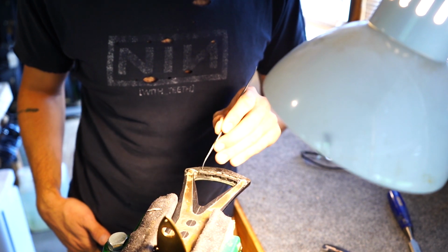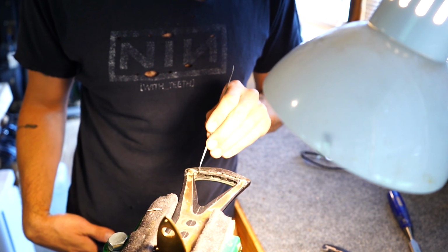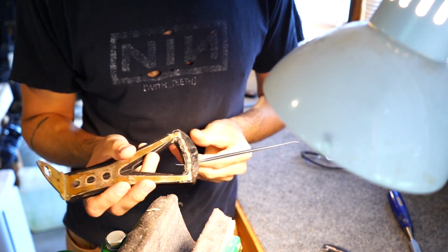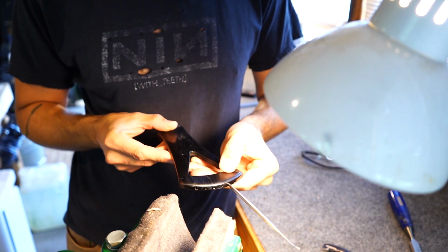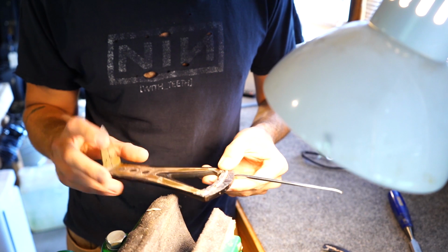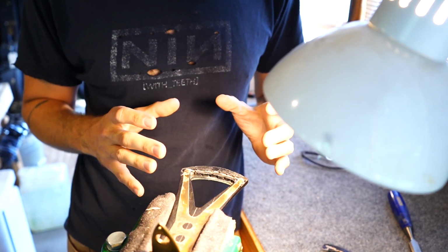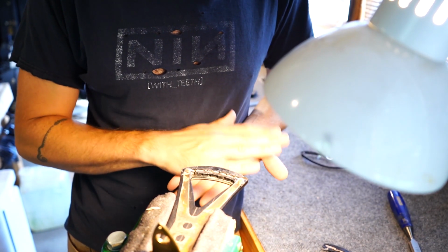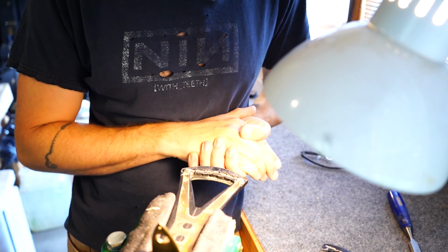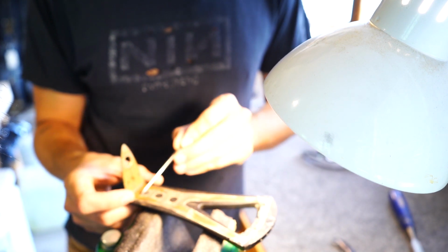And so what this does is it completely negates the brass altogether, because now your point load is coming right through that severed area. And actually, I'm curious, so here's where one piece was drilled through, and look at that, it falls right on a crack. Let's see, here's where another piece was drilled through. Let's see if that falls on a crack. Yep, right there, falls on a crack. The design itself isn't too bad, but it looks like the sequence of assembly was not thoroughly thought out.